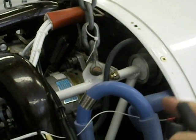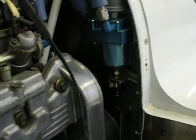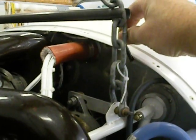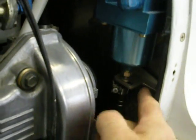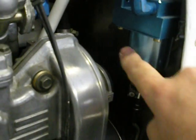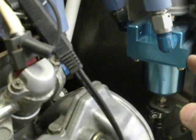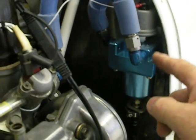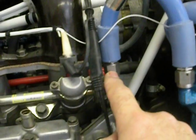It penetrates the firewall in this blue pipe just here where my fingers are. This silicone-covered pipe heads on down and feeds the gascolator. The gascolator has a little device I can pull — this cable which actuates this mechanism — causing any water contained in the bottom to be fed out of this pipe down here to the bottom of the fuselage. I can also activate it by pressing on the pipe from the bottom. Having come through the gascolator, there's another filter in there, and then it comes out and feeds through this silicone-covered hose straight into the fuel rail just here.